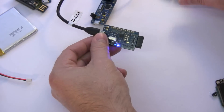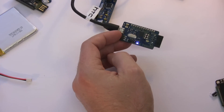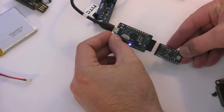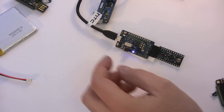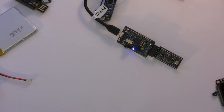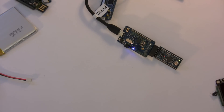Now I can unplug the Kitten and change the voltage selection over to 3.3 volts. Now I can use the exact same thing without any other changes with an Arduino Pro Mini. I'll plug it in — this is an Arduino Pro Mini running at 3.3 volts at 8 MHz. And as you can see, once again it's running the default blink sketch. So I go back into the IDE, select a different board type — Pro Mini 3.3 volts at 8 MHz — click upload, you'll see the activity LED flash, and now we have blink running 10 times a second.